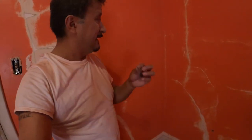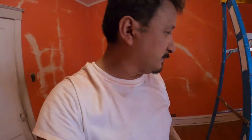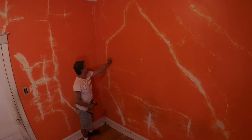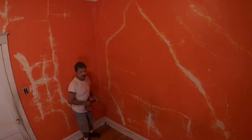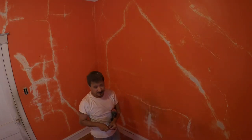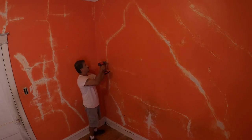Along this line there's just a crack, not broken plaster, so this area doesn't need plaster washers. But up here — push on it and you can see it move — this definitely needs a plaster washer. You need a one-and-five-eighths-inch drywall screw. I prefer the thin drywall screws. Don't go on the crack itself; go a little bit further from the crack on both sides.